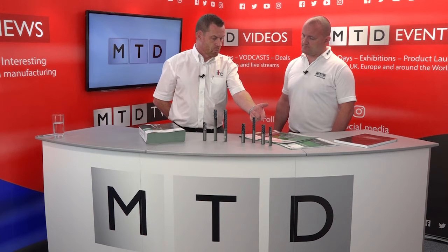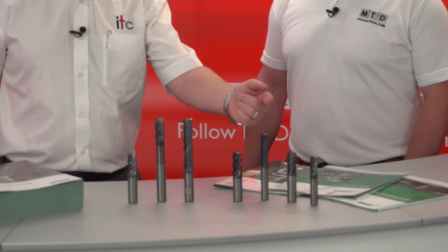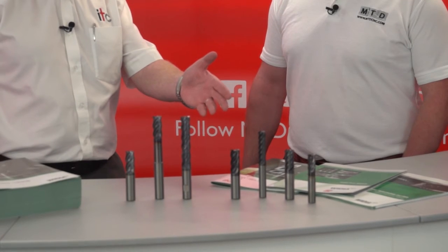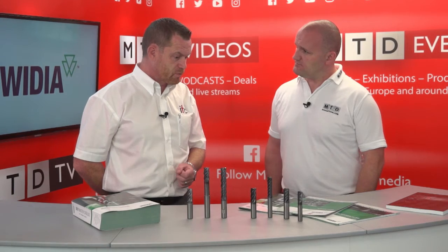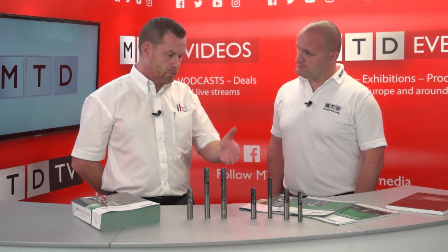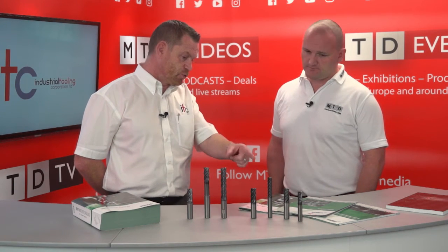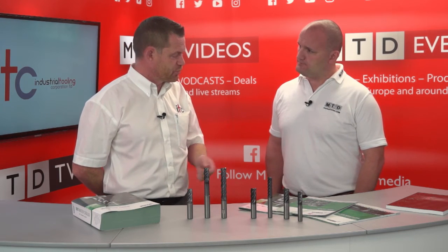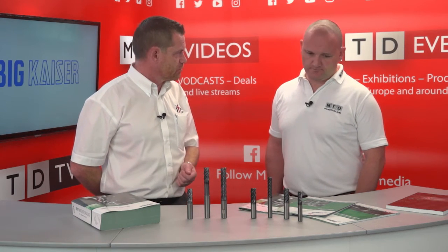They've even pushed the boundaries with a ripper geometry which still offers the anti-harmonic flute geometry as well. So you've got the chip breaker facility on that tool when you're doing trochoidal milling to actually break up the needles of swarf. So what's the advantage — obviously we're going to have shorter swarf, does that mean we can increase the radial depth of cut? Yes, that tool is designed for greater metal removal rates. The radial depth of cut will increase and as the chips get larger on a longer fluted tool you'll get a long thin needle of swarf. The sinusoidal form of the ripper will break that up into nice small chips, which with an air blast on the machine when you're doing trochoidal milling will evacuate those very quickly.